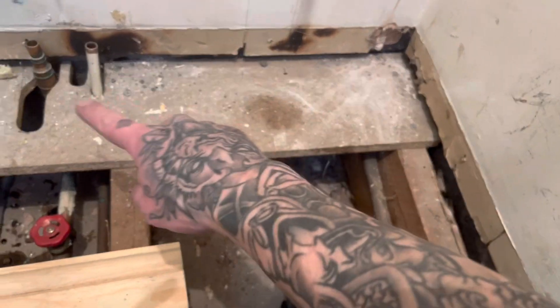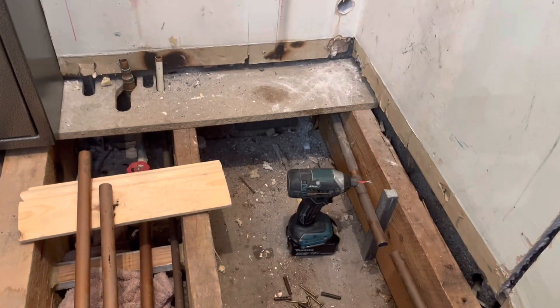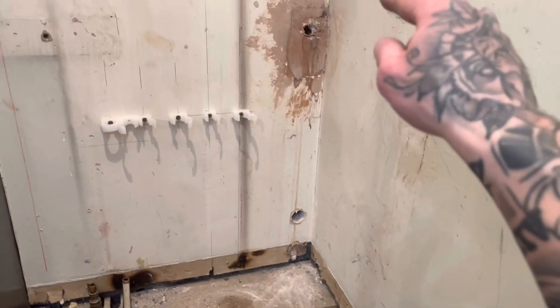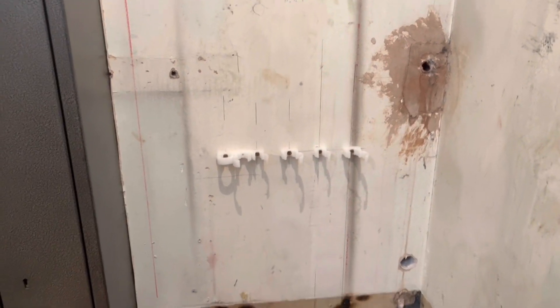Just got to cap this 15mm gas off. I've lined them straight down so I know where we're going. Obviously the pipe is going to land straight on this joist, but we'll have to give it a little tweak. Drilled that hole there for the blow off — and obviously that condensate. Because I don't want to keep peppering holes in the client's brickwork.